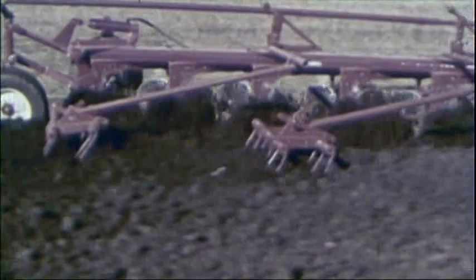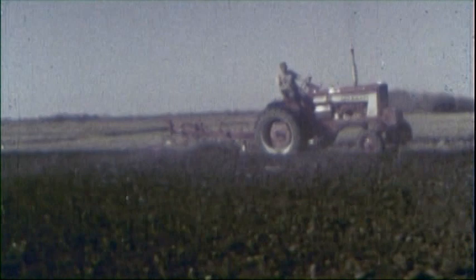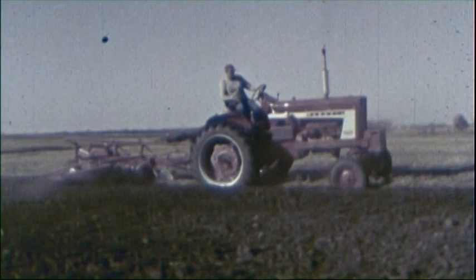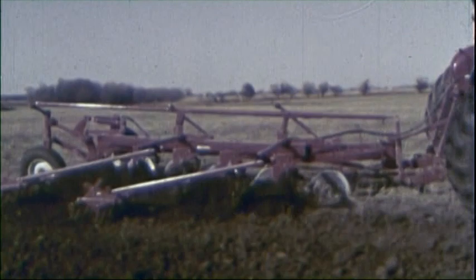Six, maybe? No trouble. International Harvester's plow mulchers are made up in 2 and 3 furrow sets. You can use 2 furrow sets for a 4-bottom plow. For 5-bottom plows, simply attach 1 2-furrow and 1 3-furrow mulcher set. Or 2 3-furrow sets for a 6-bottom. There's no limit to the flexibility of this equipment. But more important than any of this is the job these plow mulchers do.